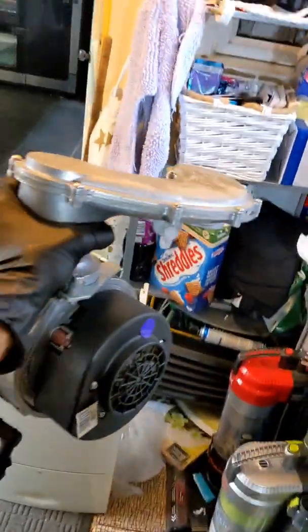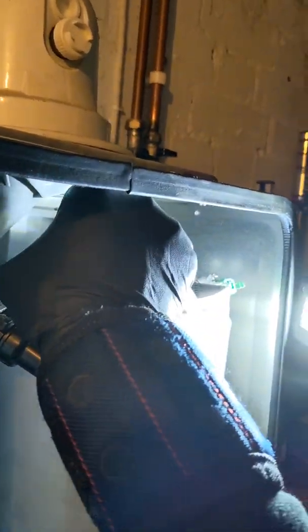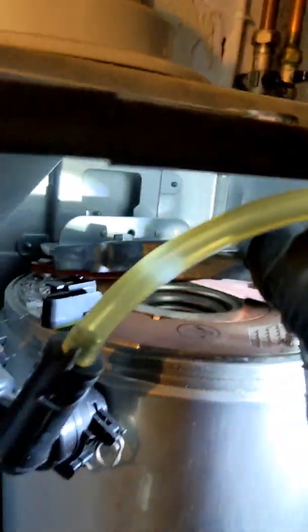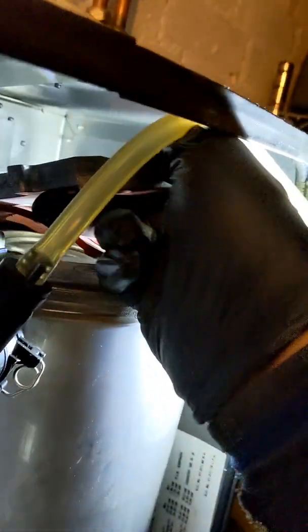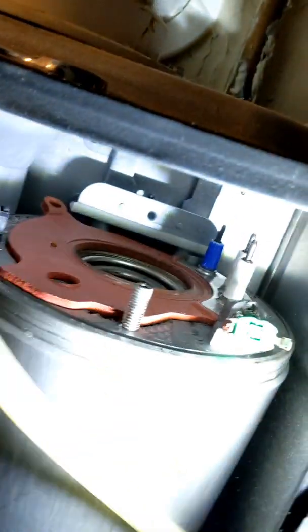The fan is out — that's the whole assembly at the top with the fan and the gas tube. Let's take off this NTC connection at the top. Now we can pull the top plate up and get to all of the electrodes. It takes a bit of wiggling about. The top plate is out now — let's get the electrodes up and see what condition they're in.